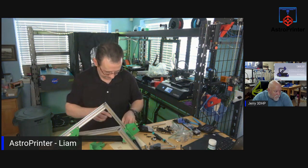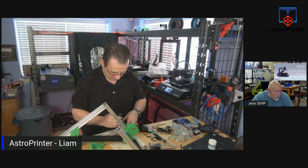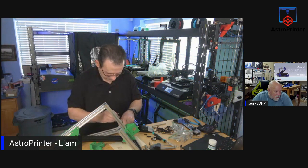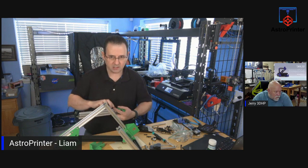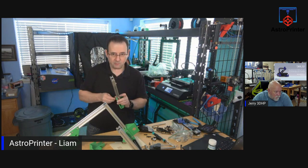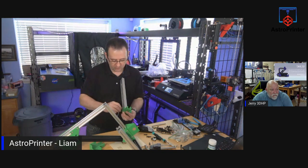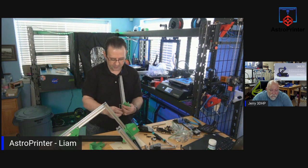Zolan says to print with ceramic impregnated filament. I thought I could already do that. I have a ceramic filament and it can print on any of my printers, even the stock Ender 3 hot end. It's not a ceramic filament. It's actual ceramic. It uses a large syringe with a large nozzle, and basically extrudes ceramic, a thick paste, and that's what you do in a printer. And it dries fast. And then you have to harden it. You have to fire it afterwards.